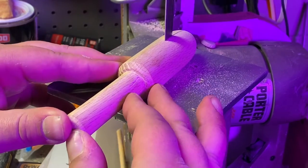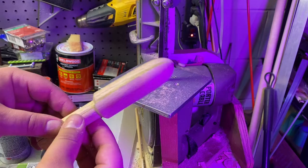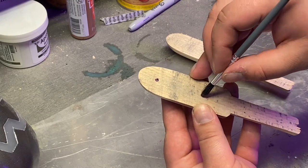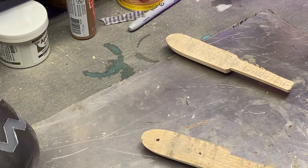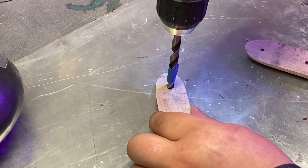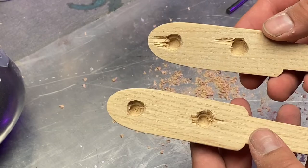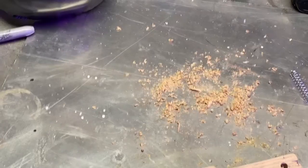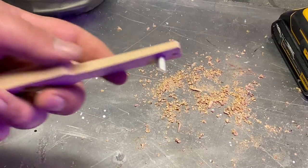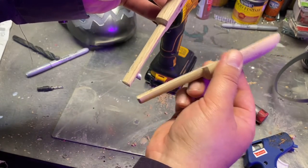After I'm done shaping and sanding it, I use a bandsaw to cut the piece in half. The two halves need to spread apart once they're fired, so I'm going to put some little compression springs inside to make that happen. I need to drill some holes into each half so the springs have room to fit inside. The quick easy way to do that is just take a little bit of paint, dab it onto one side, then press them together, and you'll have your marks on each piece. Using a drill bit that's just a little bit wider than the springs, I drill some holes about halfway into each piece. I also drilled one more hole at the bottom and put a piece of aluminum in one side, because the spring is going to push against the half that has the locking mechanism on it, but the other side gets shifted up just a little more — so with this tab, they'll fit together perfectly while stuck inside the launcher.